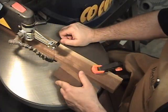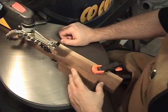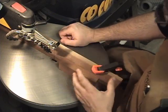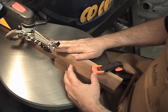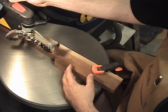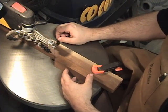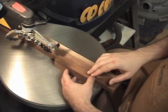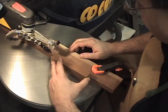We're ready to begin this re-sawing. I'm going to get the blower up out of the way nice and high. I've got the light in the proper position where I can see what I'm doing real well. I've got the clamp clamped to the table and the speed of the saw turned down very slow — I'm going to turn it down even more. This is not an efficient way to resaw lumber, trust me, but at least it'll give you a chance to cut some of these bookmarks. So let's go ahead and begin the cut.